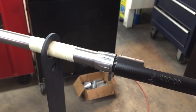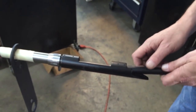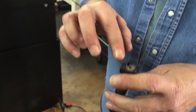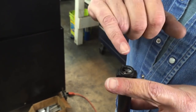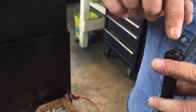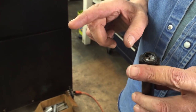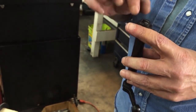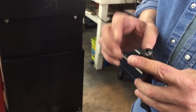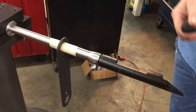At this point, since I've got the barrel nearly screwed on, I'm going to put the bolt in the Remington. I have removed the ejector from this Remington bolt, but I have not removed the extractor. These extractors are either clipped in or riveted in, and if you remove one, a lot of times you cannot reuse it unless you're extremely careful. It's not necessary to remove the extractor in a Remington. If you're doing this at home, I'd suggest you don't, because it'll save you buying another part and save you learning how to form the Remington extractors to get them back in the gun.